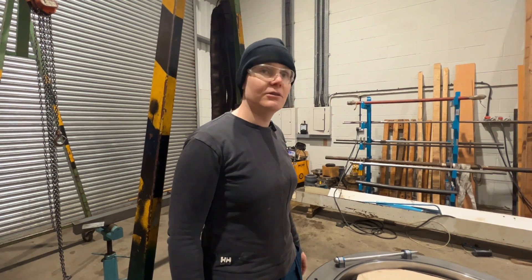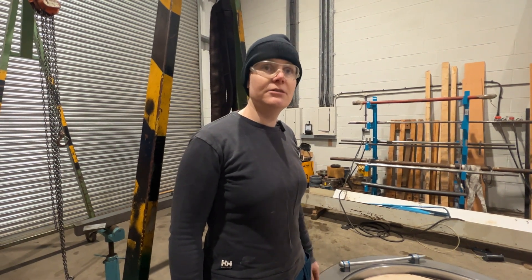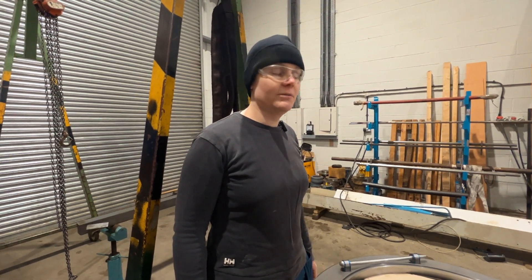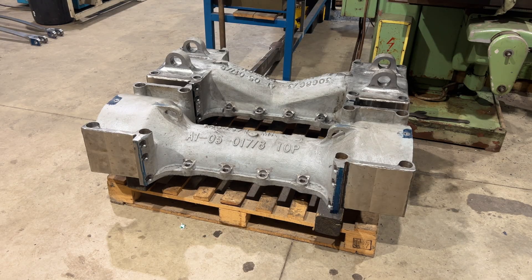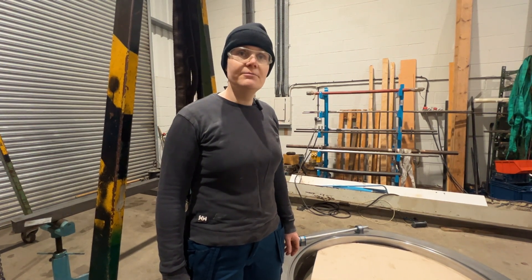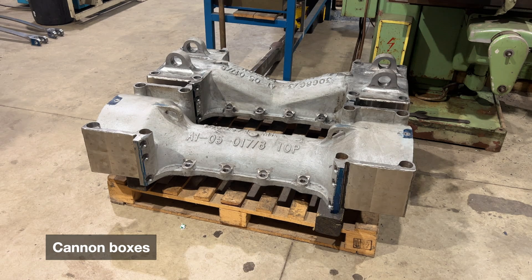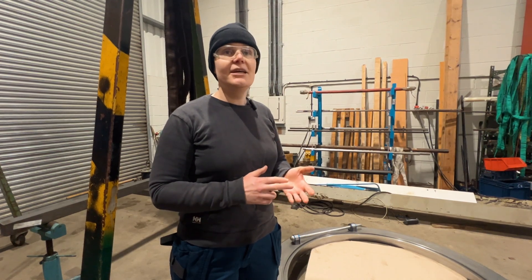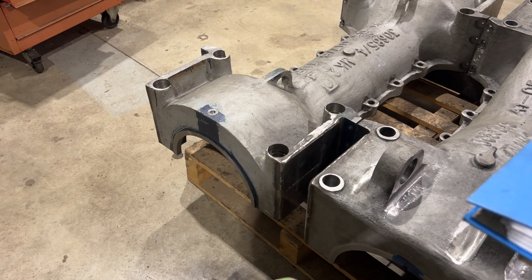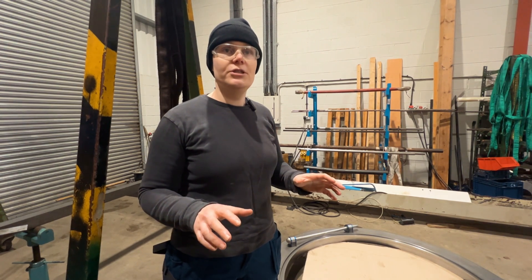Our main project we're working on is the B17. We've got quite a few different assemblies — one of them is the smoke box, and the other is cannon boxes and axle boxes. The cannon boxes started life as a wooden pattern. Then they've been cast in steel, and those castings came to me. We outsourced heat treatment and grit blasting and pre-painting. We pre-machined them, then they went for the manganese steel liners. They've been welded afterwards and came back to us.